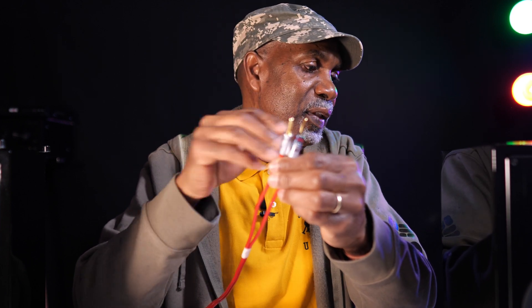This demonstration applies to a stereo two-channel setup, but if you're setting up for home theater it's equally important as you make your connections. Personally, I check and double-check every connection. If I'm connecting the center channel to my amp, I make sure the positive terminal of the speaker connects to the positive terminal of the center channel output on the receiver. The same applies to my right channel, left channel, and all front channels — positive to positive and negative to negative.